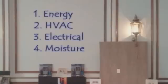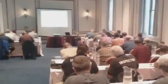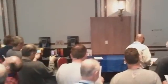We focus on energy. Energy is all about the building envelope and looking for insulation deficiencies. Did you know that missing insulation makes your heating and air conditioning work harder to compensate? Do you feel cold or drafty in rooms? Sometimes it's missing insulation. And infrared technology is an excellent tool for identification of these areas.